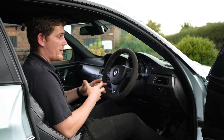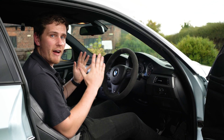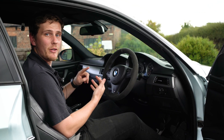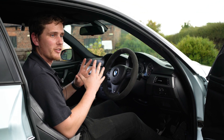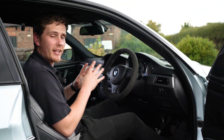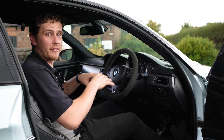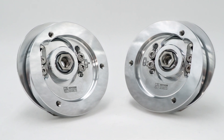The final piece of the puzzle — and probably the longest part of the process — is the testing. We're going to be testing these camber plates in all of their various camber positions, taking it on the road and on the track, really putting the car through its paces. We're going to be looking out for bearing binding, any noises, and any contact inside the wheel arches in the various positions. Only once we're completely happy that in all those positions these parts can stand the test of time will they be listed for sale. You may have noticed the previous video was a while ago compared to this one — that's because we only post this video when we are completely finished with the development process and the parts are listed and ready for sale.